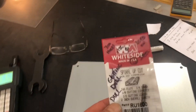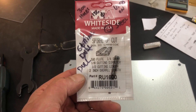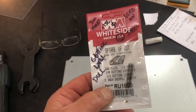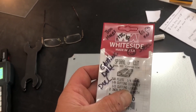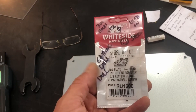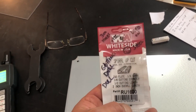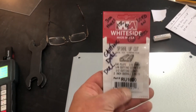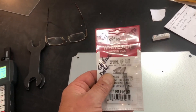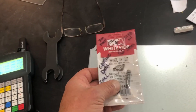First, let me show you what I started with — a Whiteside solid carbide spiral upcut, one-eighth inch cutting diameter, two flutes. Now, this was getting dull already when I started with it, and now it is dull. It's basically just the very tip — the very corners are heated up — so I know my feeds and speeds are not perfect, or this probably would have cut better. But I got 300 holes out of this, and it had already been used a lot for aluminum and for plastics.